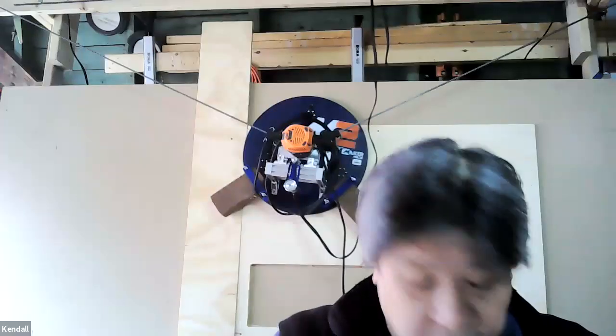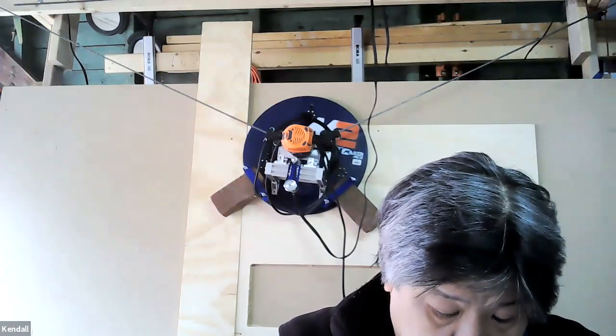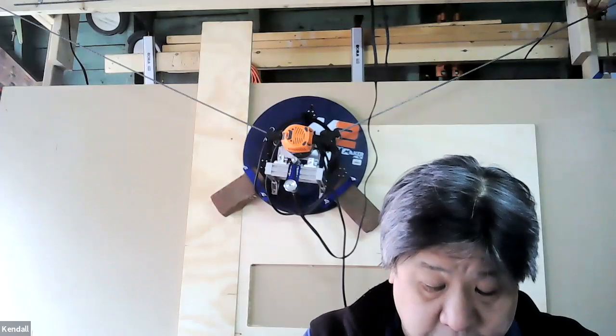And so we can calculate that math once you say that you are centered on your wasteboard. Mm-hmm. Now, in the newest version of Makerverse, which is 1.1.2. Yeah, that's what I'm running. Okay, yeah. So in 1.1.2, the calibration flow has a procedure where you can measure your chains, similar to the ground control calibration aspect. Yeah, that's part of the initial setup for a new workspace. Yep. So should we do that or not?